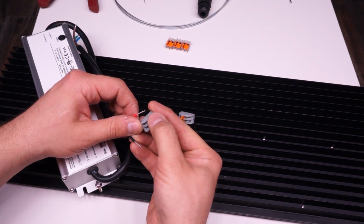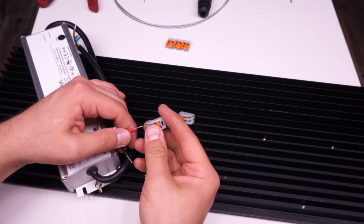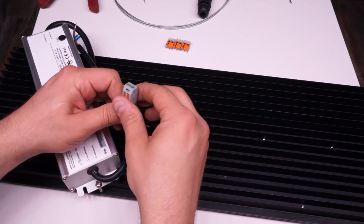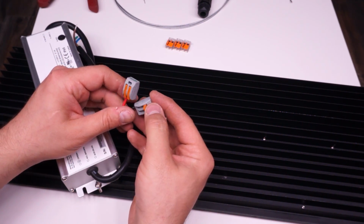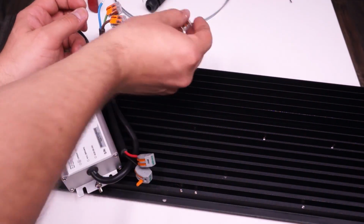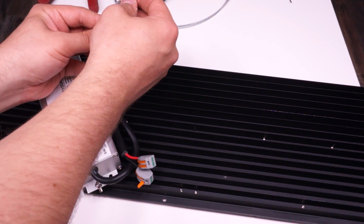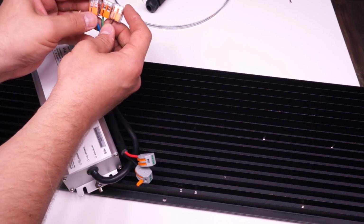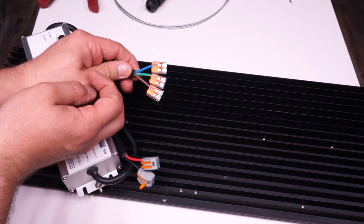They're both super easy to use and they both work well, so no difference there. And then on the AC input side, I ended up using the 3 little clear Wagos rather than that big black waterproof connector. And on that one, I think I'm partial to the waterproof connector, mainly because it's waterproof, but also because of those 2 collars that clamp down on the jacket of the cable. I think that strain relief makes it a lot more robust and a little bit safer, so I like that other connector more than the little Wagos for power.